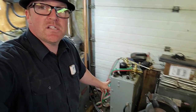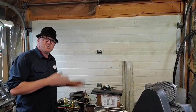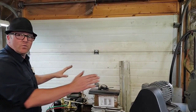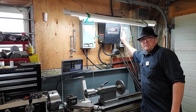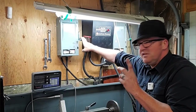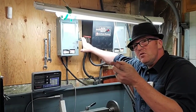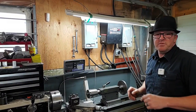From the phase converter, power goes down to two transformers — a 600-volt transformer and a 440-volt transformer. I've got some junk on them right now that we'll clean up over the next year. These transformers are on a wheelbase setup in front of the bay door, making them portable so I can roll them out of the way when bringing machines into the shop. From the transformers, power comes back up to my disconnects — one for 440V and one for 600V. These disconnects are super important: without them you'd have only two phases running into your machine and not the third leg, which can burn out motors.